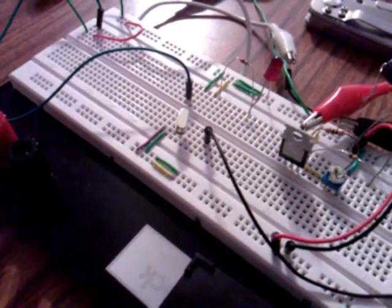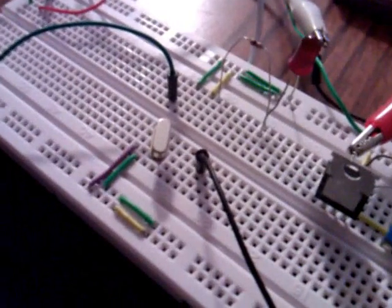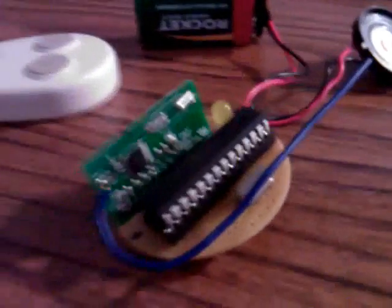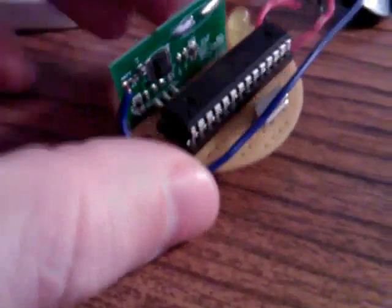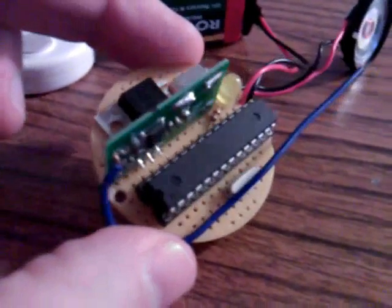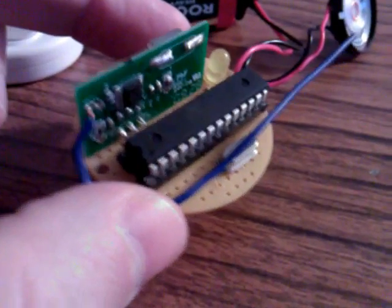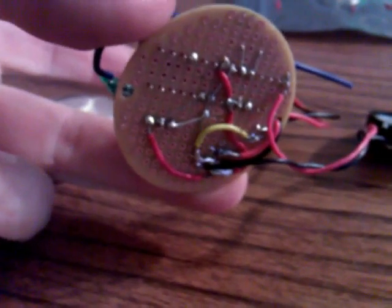You can see that the wireless transmitter and receiver is gone and that the Atmel microcontroller is no longer on the breadboard. That's because this afternoon I took a little time and I soldered it onto this little breadboard — it's all connected in this little self-contained unit. You can see I've got the nine-to-five volt regulator, a yellow LED, the Atmel microcontroller with a 16 megahertz crystal, and the wireless transmitter/receiver daughter board. On the back side you can see my solder work.